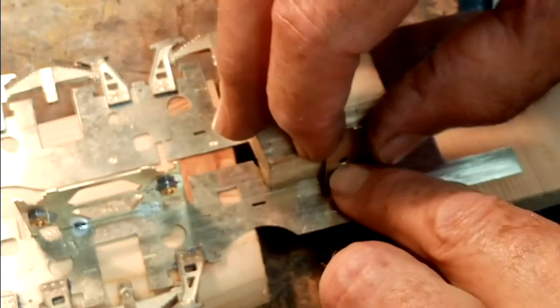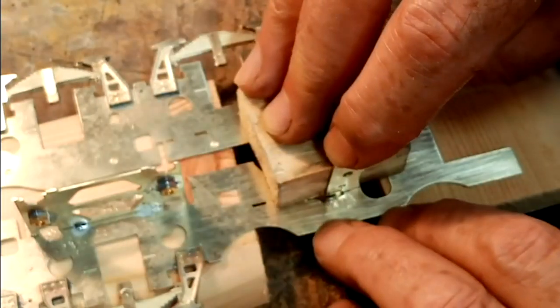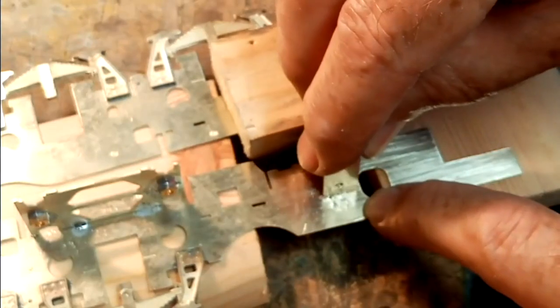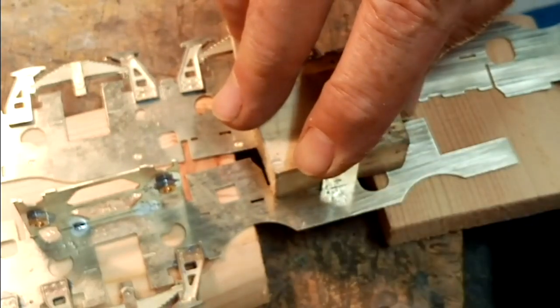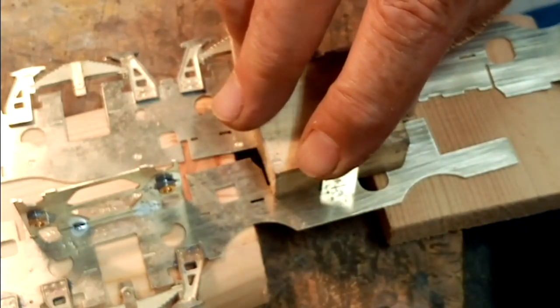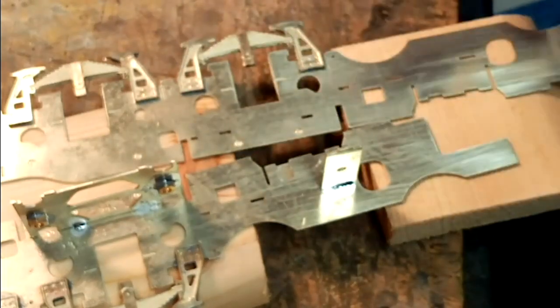This is the bogey frame, the bogey support frame. So again, just hold it in place. I'm finding that some of these slots are just a little bit tight, but they're popping all right. So now, holding it square, just a little bob of solder there. And then the other frame,